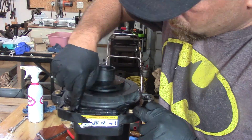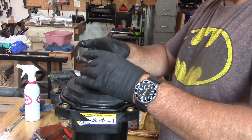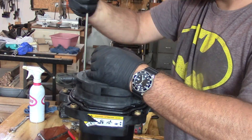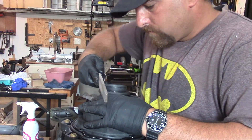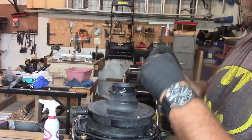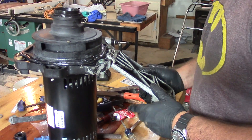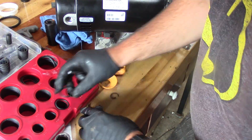I'm putting back on the main seal and applying gasket lube all the way around. The white spacer goes on with the lip facing away from the motor. To get the plastic piece started, I put the screws all the way through the holes and lined them up to make sure they would tighten right in. There was a rough edge so I just filed it down a little. The last step was to lube up the big two-inch opening and put on the heavy o-ring. I also used some o-rings to replace the o-rings on the electrical connection.